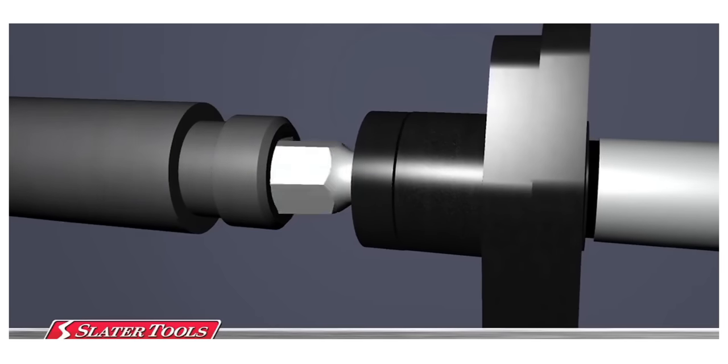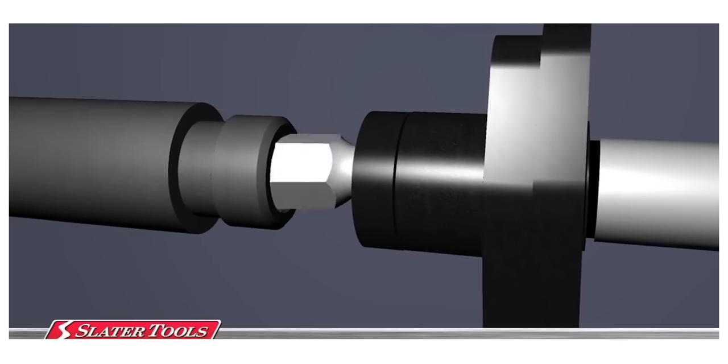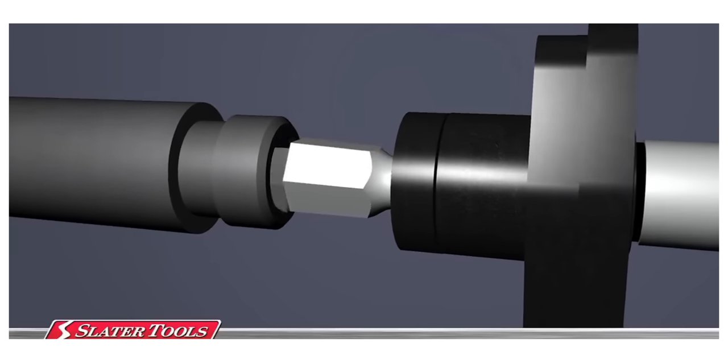Now this does two things. It alleviates the tool pressure, but it's also part of the reason why it's so precise. If you took the whole form and tried to crush it onto the part in one go, it would be a lot more tool pressure and it would actually form a way less precise shape. And that's why it works so well. All right, now enough of this tape example. Let's get on to other stuff.